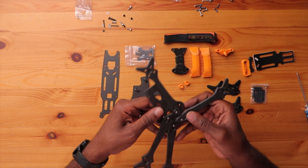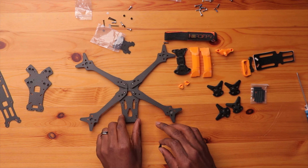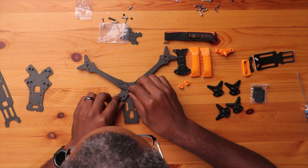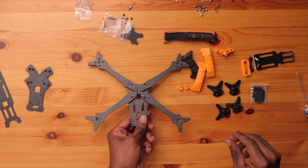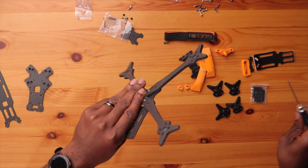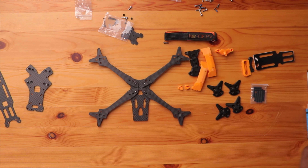We now have all four arms in. As you can see, the arms are moving around and jiggling left and right. So what do you do? You get this jiggle key — that's what they call it — and that keeps the arm straight. Slip it in there carefully, and there it is. Now that this jiggle key is in, we just tighten down the bolts. That's pretty nice and secure.